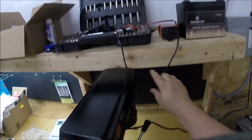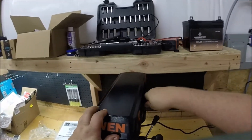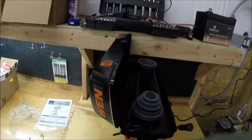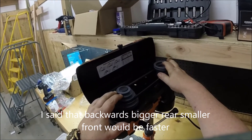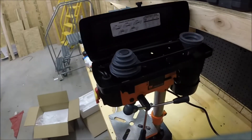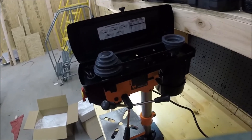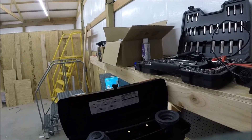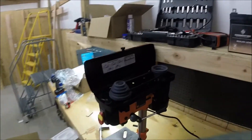It's five-speed. Up top here — you just loosen that cover and you get to set your speeds. The higher you go here and the smaller you go here, the slower it's going to be; and the higher here and the smaller here, the faster it's going to go. It's actually got the speeds listed there. Currently it's set up in the middle at fifteen hundred and thirty RPM, which is probably a pretty good standard speed. It even gives you the speed RPM range for iron, steel — quarter inch at 1530 — and seven-eighths on wood. That's perfect.